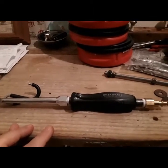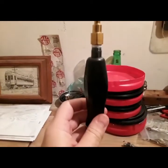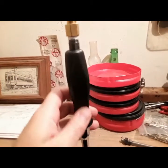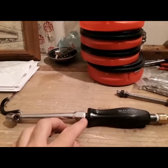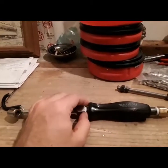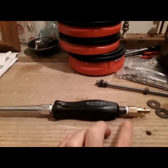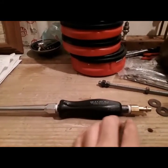After that, I went over to my press, and with this side down, seated against the pressing plate, I pressed from the top all the way down until it bottomed out. Then I got a socket — a one-half socket — and pressed it through just until most of these threads started coming out, but not to where the pipe was protruding. What you want is more of the pipe protruding on one end so you can see the black steel, and this side having the black steel and a nice brass fitting.